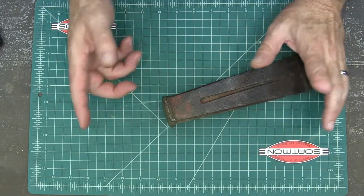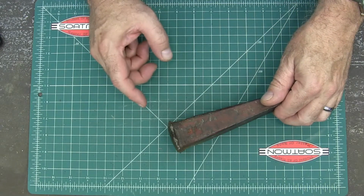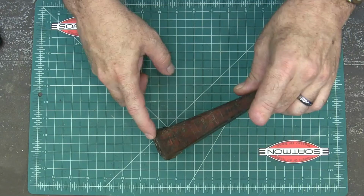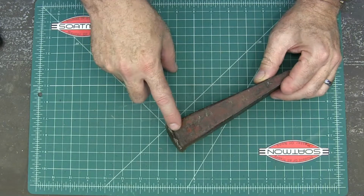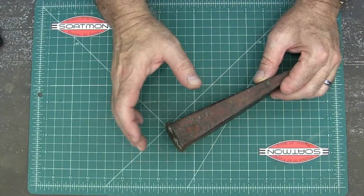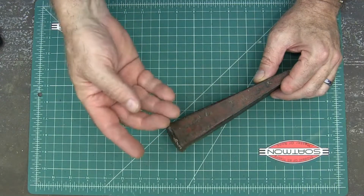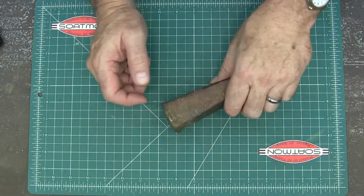And you know, in the past I have maintained my wedges, but not as well as I probably should. You can see this one right here is terrible. It's all mushroomed over on the top, and that's what happens when you hit that really hard. A piece can come flying off with a large portion of the energy that the sledge hit it with. And so a little piece of that moving with that kind of energy can definitely embed in your skin. You should always wear eye protection.